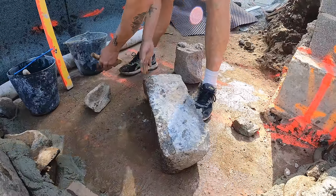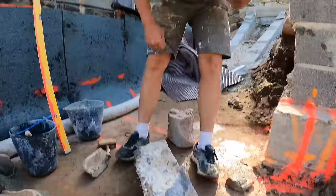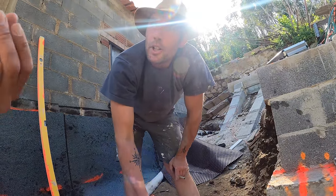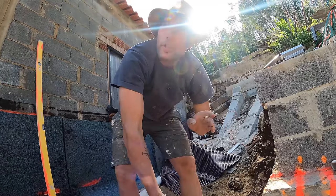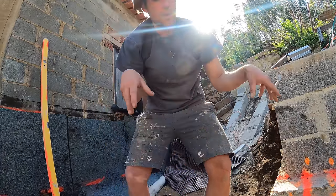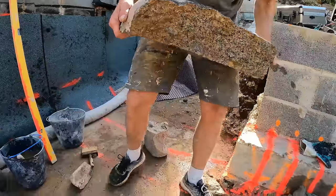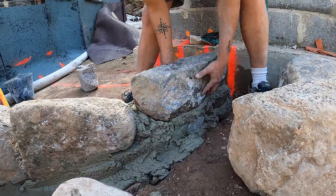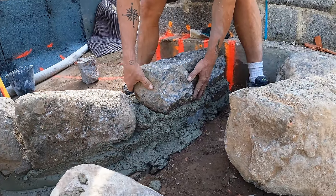Why do we wet it? Because otherwise you always have a little dust layer on top. It doesn't give it like a good... And then it would actually separate the stone from the thing. And once you make it wet, it just becomes one. Okay. So it's clean it, wet it, stick it. Yeah. Every stonework has always to be done wet.